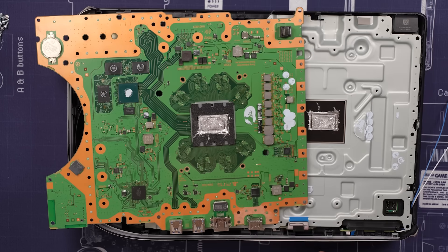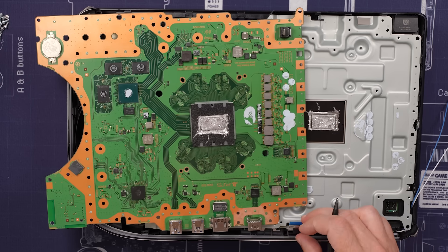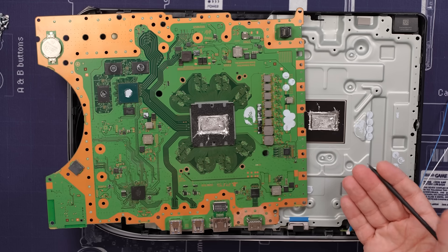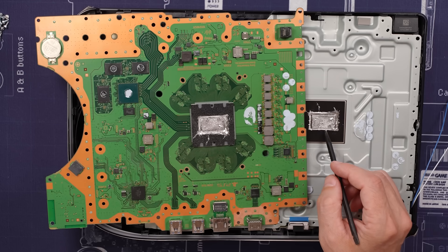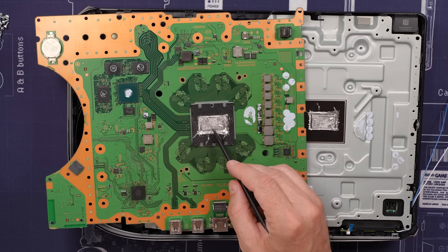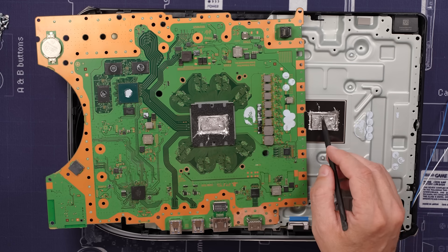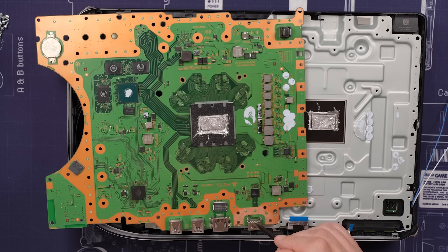With this apart I'm actually pretty impressed overall — there are no torn ribbon cables or anything like that, none of the connectors are taken off the board, and there are just a few missing screws, but other than that this is looking great. Now the liquid metal — there's definitely a problem there. I can see some hairs or something, and not enough liquid metal. There are three dry spots right here and kind of a dry spot all the way around, so we definitely need to deal with that. But the HDMI port is what we're here for — let's take a look at that.